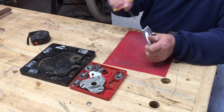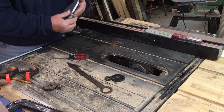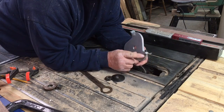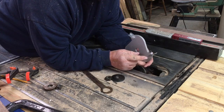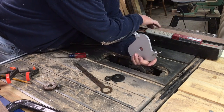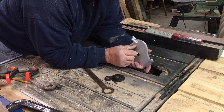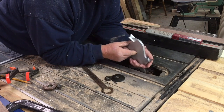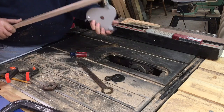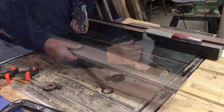What I'm going to do next is install my molding heads. With each set of molding heads you have to decide which way the cut is going to be — sometimes you have to run it on the other side of the fence, sometimes on this side of the fence. With the particular cutters I've picked out, I kind of held the board up and looked at where the profile was going to be on the board.